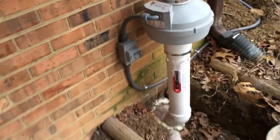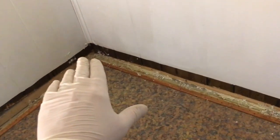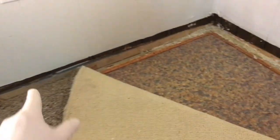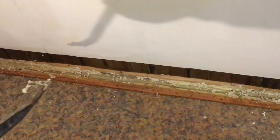We're moving a pretty good amount of air there. Let me show you inside why we did what we did. There's the outlet powering the fan, and we didn't have anything to work with over here. But when I fired the fan up, I heard a real loud hissing sound. So I had to get these baseboards off, take a pry bar, push these up, and spray that gap filler foam in there to close that air gap.